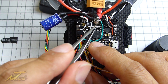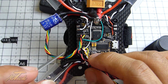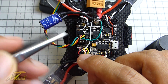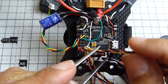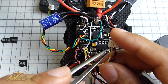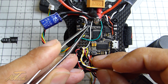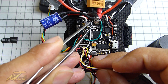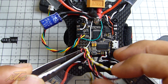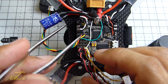You can just see that on the other side of this huge ground side of the main power cable, and then down here — this is probably a little trickier to see on camera — but what I've done, as I discussed in the previous video, we have the connector here for the TBS Unified Pro. We have the video, the smart audio which is the white cable running off down here, going to TX3 on that side, and then on the power side you've got the plus and minus going to the RAM pin and the A ground, giving us filtered VBAT voltage.